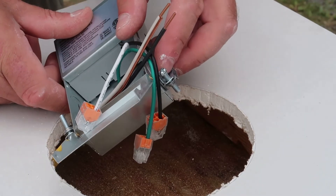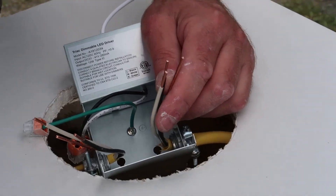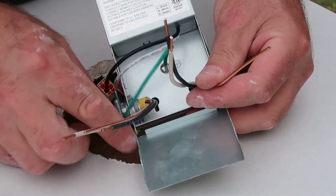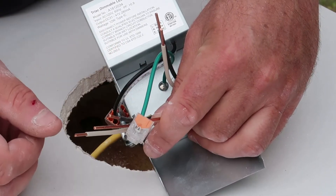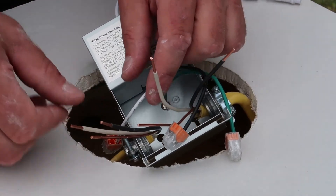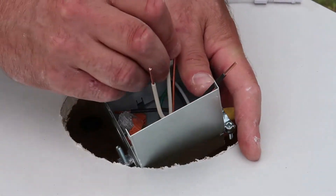Once that's done, tighten that clamp. Your main power coming in from your light switch is going to come into this box, and you do the same exact thing. It's real straightforward. All your bare ground wires are going to be connected into the back of the green — put it in the hole and push until it locks, then pull it to make sure it's tight. The black goes to black, the white goes to white. Really straightforward. After locking each one in, pull back on the little holder and make sure it's locked in place.